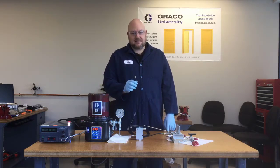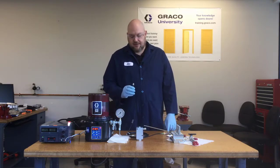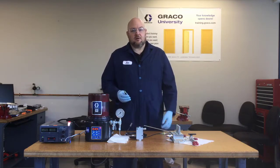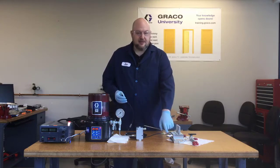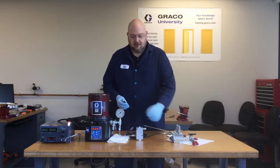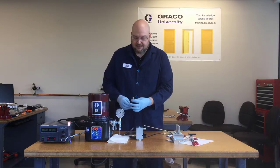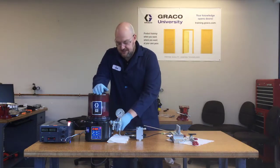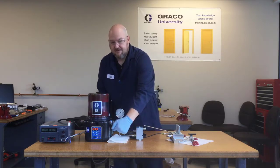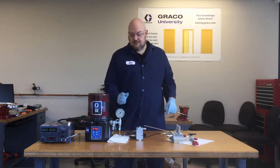The way I simulated it this time was by disconnecting the cable from the proximity switch or the cycle switch. That's a possibility out in the field — maybe your cable came undone, snapped, or got cut, or maybe the proximity switch has actually failed and is no longer working. Another sign is that the relief valve didn't dump any grease out, so the pressure gauge wasn't showing any pressure.